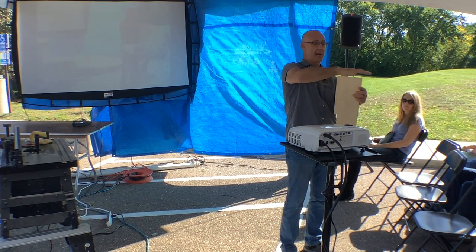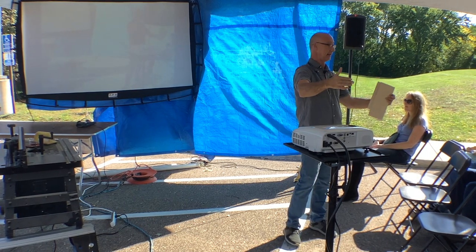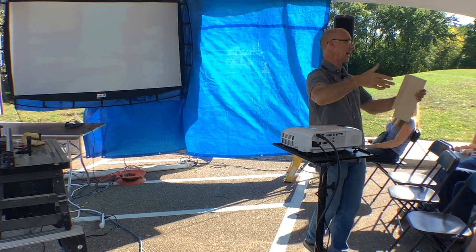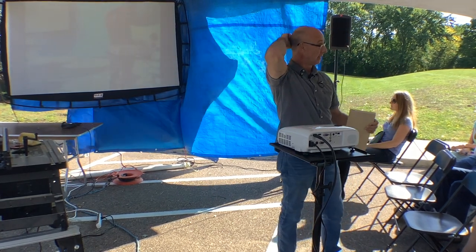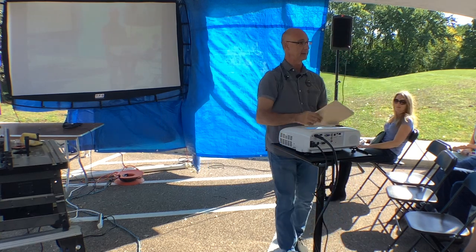That then tells me how long my drawer front and my drawer back are going to be to accommodate fitting into an opening at all, or fitting between drawer slides or whatever it is you're trying to do. So you've got to start with test cuts and then finesse it from there.